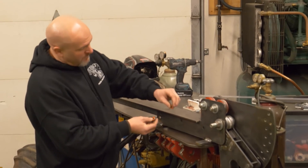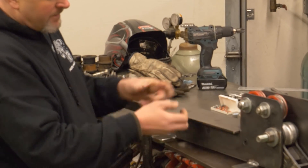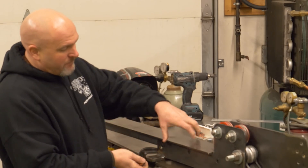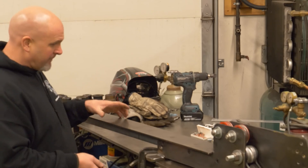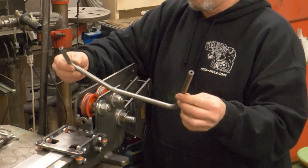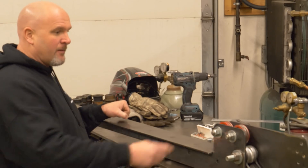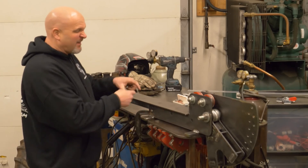If you follow me on Instagram you probably saw a post of some skateboard bearings. I'm going to use those bearings to create a little trolley that rides back and forth on the cold rolled flat bar. I'll have a pair of bearings on each side that rides on top, a pair on the bottom to keep the trolley from rocking, and bearings on each side that ride the edges to prevent twisting. It'll roll up and down but won't twist or rock. A clamp on the trolley holds the tube end - for example, a part with three bends of different degrees all needing to be in the same plane.